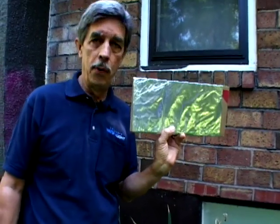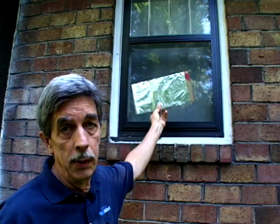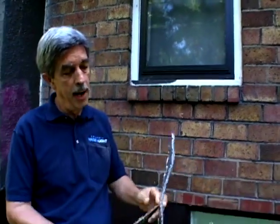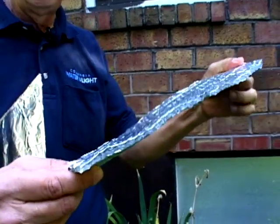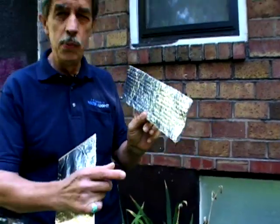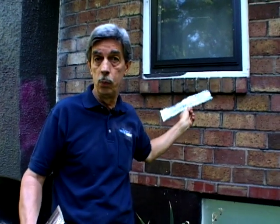That's a little pricey, and if you've got older ones like this and you kind of like the style of the house, here's an alternative. You can simply take aluminum foil, staple it to the back of a piece of cardboard, and slip that between the storm window and the interior window. Or there's a product like this — it's a bubble pack with aluminum foil on it. It has an insulating value, it's really easy to cut, and easy to install between that storm window and your old window.